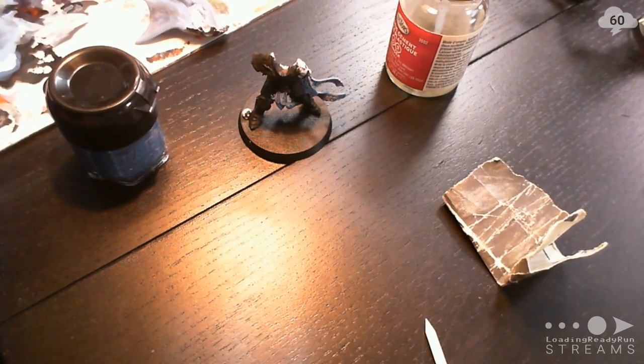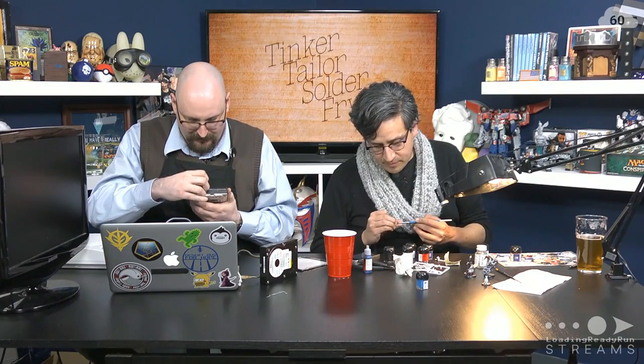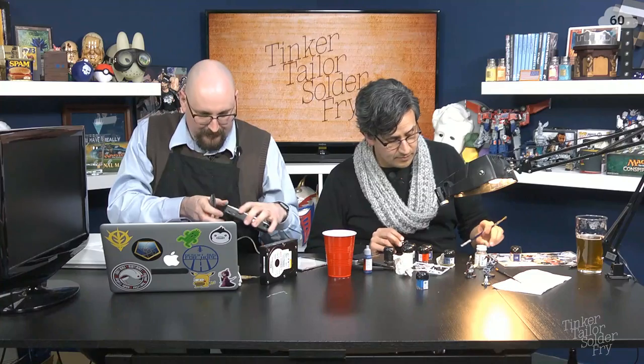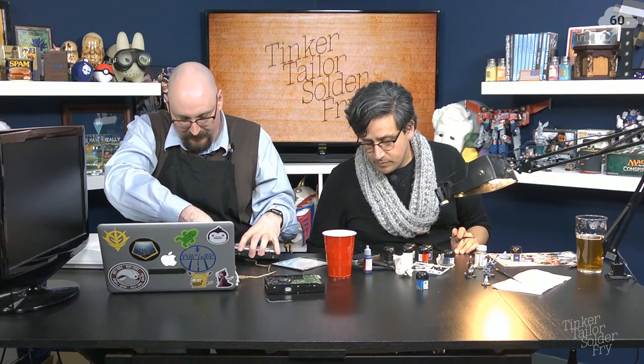Okay, power down the drive. Well, disconnect it. Turn it into a slave by correcting the jumpers. And now let's attempt to connect it. Wait, no, that was too soon. I haven't installed anything onto the drive yet. Plug it back in, push this down, repower the drive.